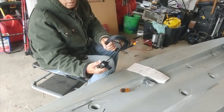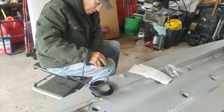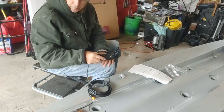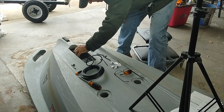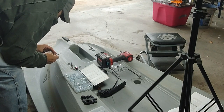I'm beginning with the transducer. I've got the kayak flipped upside down here, showing you the transducer with the cable. There's a mounting bracket for it that I had to install, and then there's a 90-degree angle mounting bracket that affixes it to the underside of the kayak. You can see the rectangular hole that's made for mounting your transducer, hopefully to keep it from crashing into the rocks. On the right-hand side of that mounting location is a black nylon or UHMW mounting block — that's what you screw the transducer mount into. I had to pull that out, mark the hole location, and drill the holes for the transducer.